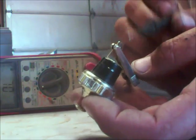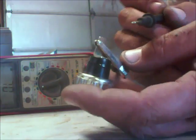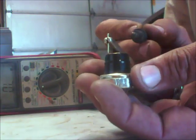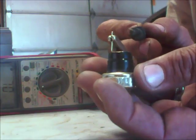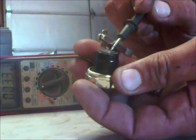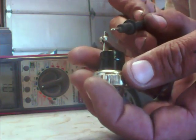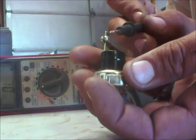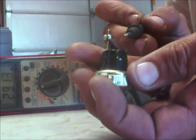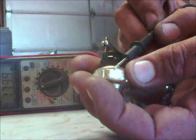Now, let's say you have two prongs on here — this prong and a second prong over here. On that one, all you have to do is touch going across. Just on one side of the wire; even though it's isolated here, we don't care about that, because the connection gets broken on the inside. So just connect it to the one wire clip and the other second wire clip and you should have continuity, just as we did across here with ground.